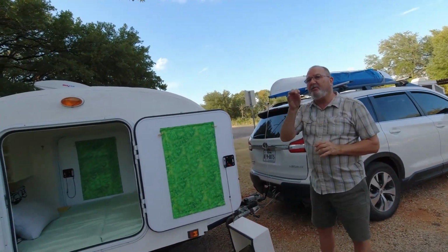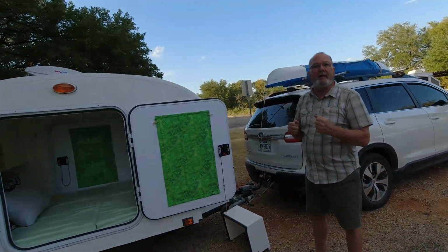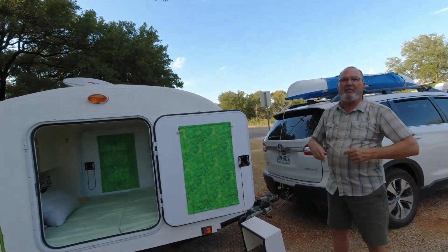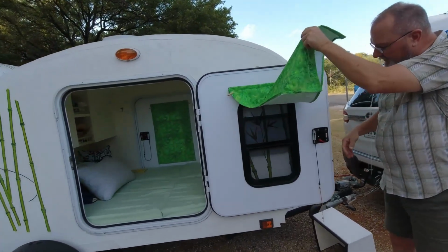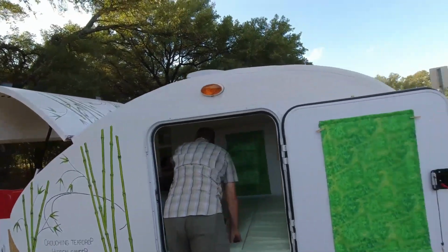Those 2 things: 1, it brings in fresh air. 2, it pushes the heat down. And so it goes into your return air and says, oh, I got to keep working. And so it keeps the cycle going and dehumidifies instead of having cool, damp air. Okay, well that actually makes sense. And so you have to have your windows cracked a little bit. And I've got little 1 by something blocks here.